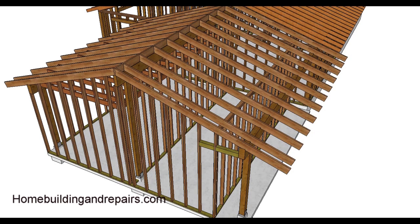Now let's look at some modifications that were made and some helpful suggestions. What we currently have is a wall built underneath the overhang, and one concern was that the fascia might create a leak - that you can't just have the fascia board on top of the rafter on the edge and need some type of overhang. But that's not necessarily true. If the fascia board is installed correctly and you do not have any water leaks on the inside or visible on the wood or ground, everything should be working fine.